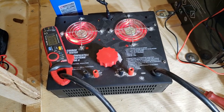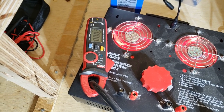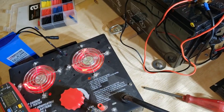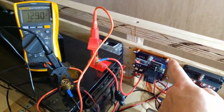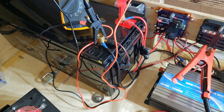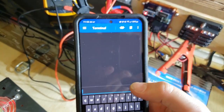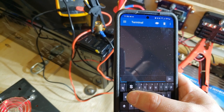I've made a little adjustable dummy load — just a load tester — and I've got my clamp meter here too so I can get an idea of the current. One of the meters is beeping at me and I'm not sure which one. Anyway, what we're going to do is draw some power and see how accurate the power manager is. Give me one second to get the phone so we can view this over Bluetooth. I've got this serial terminal app running here — it's connected to the Bluetooth.